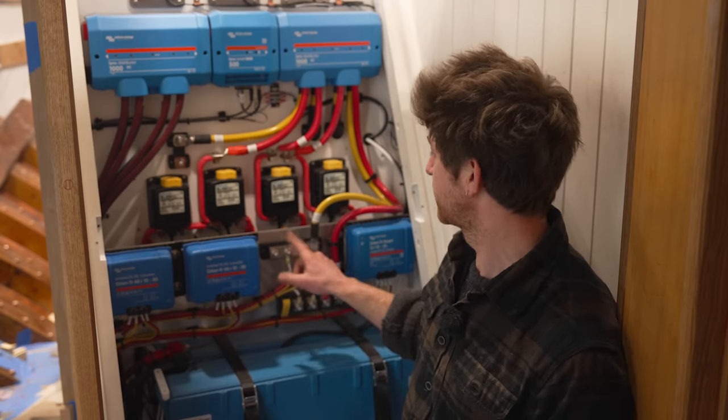And to control that engagement, there's a bracket that moves, there's a cable, and there's a Morse control. Now, to re-engage the shaft clutch after the engine has been used as a generator, it's very likely that the dogs won't be lined up, and so they won't be able to engage.